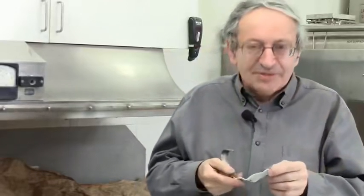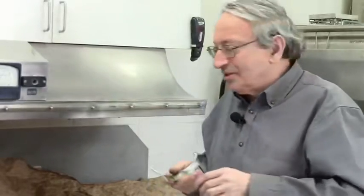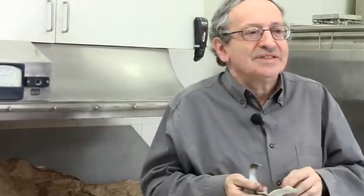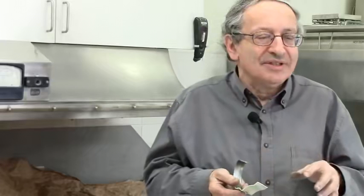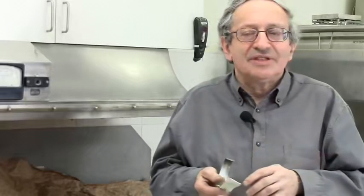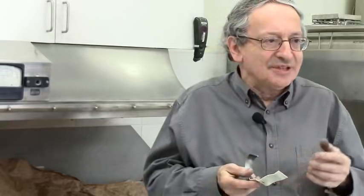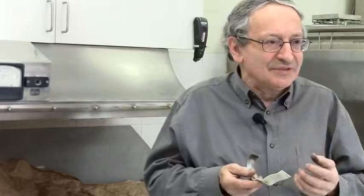So the next best thing to sandblasting is either bluing it. Bluing it is heating it to about 300 degrees Celsius, or scrubbing it with these bathroom cleaners like Ajax or Comet. And the reason is that these bathroom cleaners activate the surface. They not only remove the oil, they actually activate the surface because they also oxidize it.